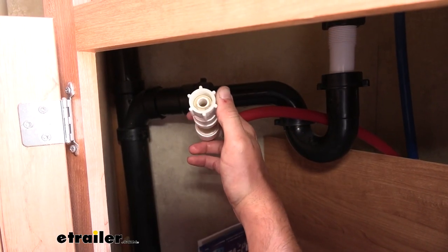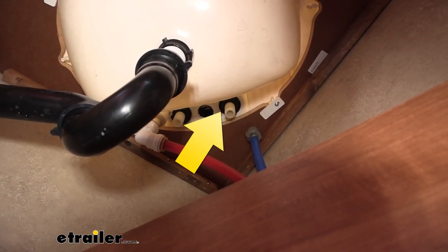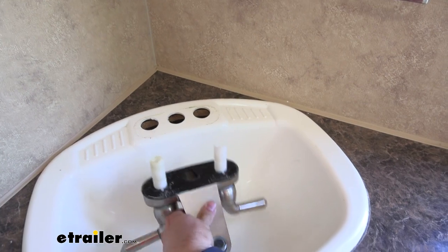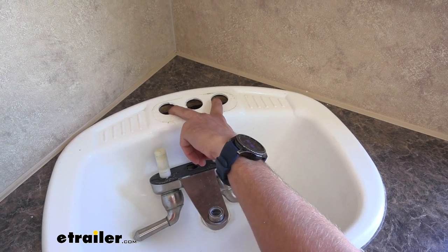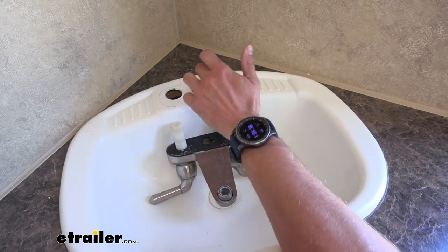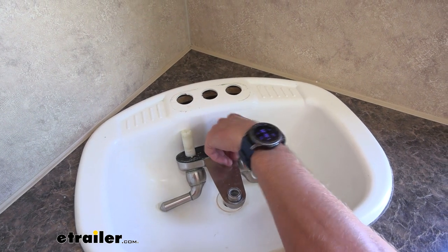Here's that little connection point — it just screws on, so we can go ahead and get our cold water inlet out and start unscrewing our faucet. If you look at those two inlets, there are black rings around them that have little tabs you can grip and unscrew. With both rings removed, we can lift up our faucet and see both water inlets. Now the next step is measuring your sink's water inlet holes. Ours today is spaced four inches apart, center to center, so we know we need a faucet that is four inches center to center — or if we have a single inlet faucet, we just need to make sure we can cover both holes with the deck plate.